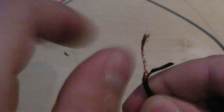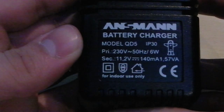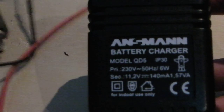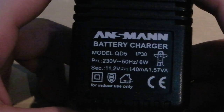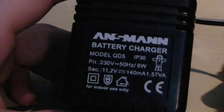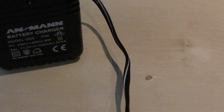It's got two wires. I've actually taken one off there just to demonstrate. The plug I've got has a voltage just underneath that — 11.2V and 0.14A, so it's underneath 0.17A. It says milliamps on that one so it's 140mA. I'm going to be using this — it's just under, so it won't overheat the actual fan but will keep it at a steady rate, just a bit underpowered.